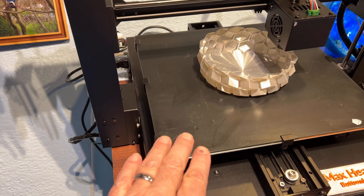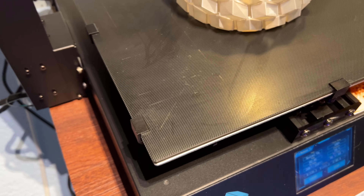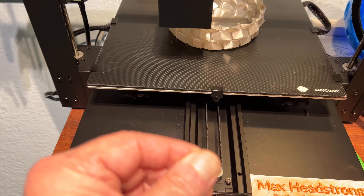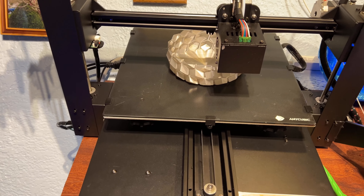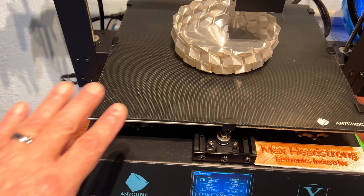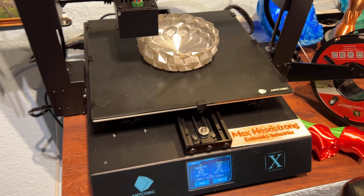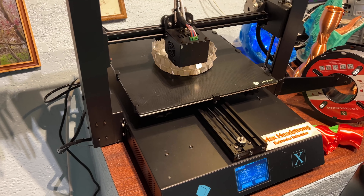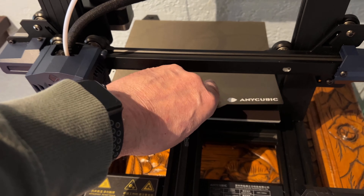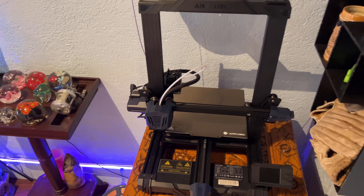The final thing is your bed. The bed on this machine is glass and has these little tiny holes in it. When it's heated, the plastic adheres to it; when it cools, the holes release the model and it just comes free easily. Glass tops hold so much better — the model adheres well and holds its shape and characteristics better. The quick-release beds change alignment and let your model come free easily but don't hold quite as well, and that's why they're cheaper.